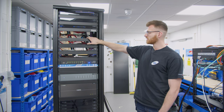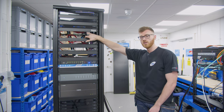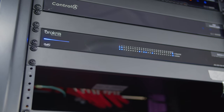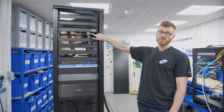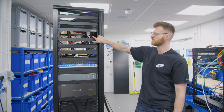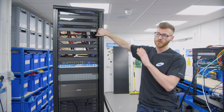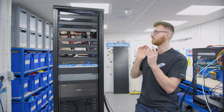Above that we've got a 2U gap at the minute — that's where the CCTV NVR will go. Then moving up, we've got a 24-port rear switch which is just providing data to all the devices in this rack, and its uplink is on fiber on this job. We've got fiber doing the uplinks for all the switches. The reason we've done it on this one is because the SFP ports on these are a separate backplane to the rest of the ports, so the uplinks don't share any of the bandwidth.